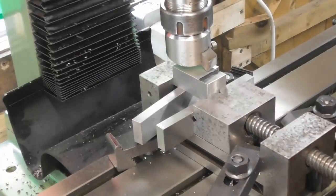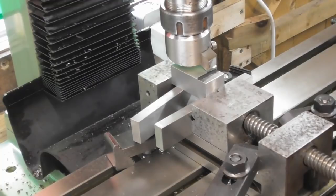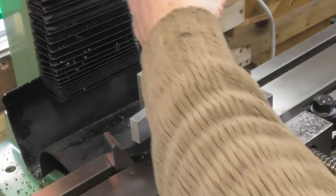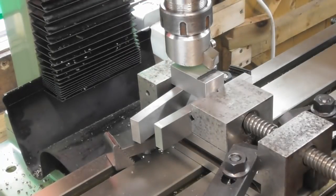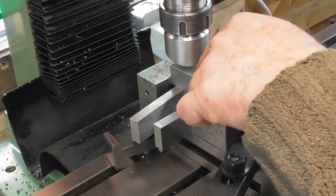So I'm going to come over with my table, I mean, it's not a critical dimension, this, but I'm just eyeballing it. Make sure that tool's square. That's it. There, I think will do me. So I'm going to lock my table there, or my saddle. That's locked. So that's a fixed position. I can use the same setting for the next block.